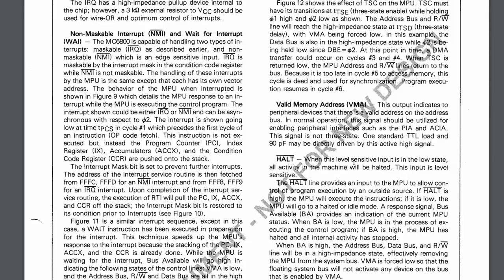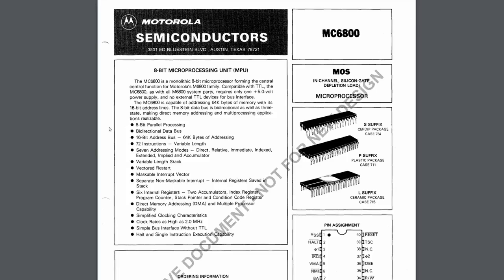Not really knowing where to go next, I took a look at some schematics for memory boards on this machine and noticed that they are taking into account this VMA signal — valid memory address — in the select logic. So because I had an extra AND gate on my little memory board, I changed the chip select logic for the SRAM to make sure that VMA must also be high when it's reading or writing. And even though, according to the timing diagrams, that doesn't seem like it's going to make any difference whatsoever — would you believe the computer now works perfectly?